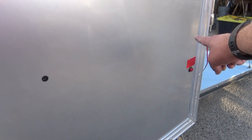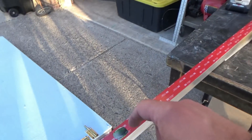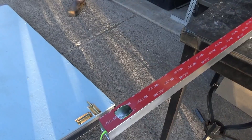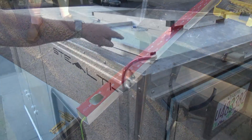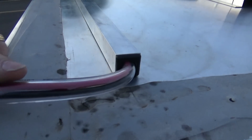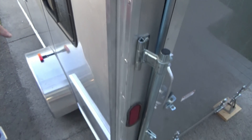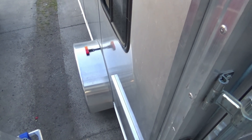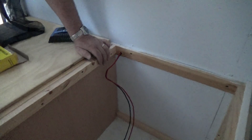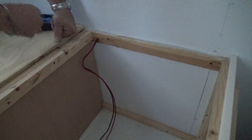The wire chase is going to come down here and shoot straight across. We drilled a hole and we have a grommet right here, and on our metal piece we also have an area large enough that it's going to fit around the grommet and seal on both sides, so we're going to run our wires through and into the inside. The wire is going in right about here — I wanted the wire to come out close to the center partition so I'd have room to go whichever way I wanted to with all the different controllers on the battery.